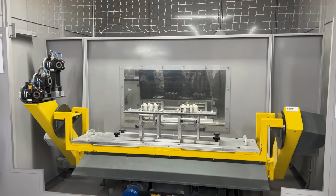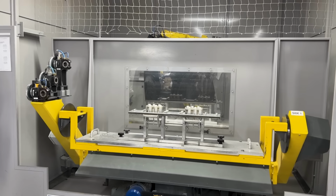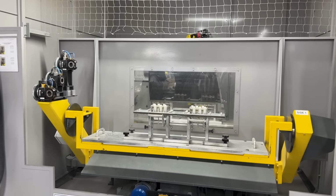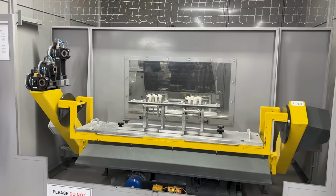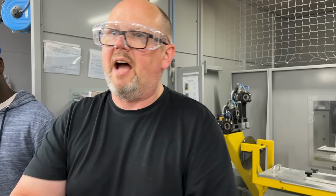And what it's doing is constantly monitoring the amount of pressure it's putting down onto the surface that's pushing up against it. The reason that's relevant, of course, is if you think about a loudspeaker, it's got holes in lots of different places. What we don't want is the robot to push hard on a flat surface and then get to a point where there's an aperture for a drive unit and suddenly dip in. If it dips in, it would round off that nice sharp edge that we want. Clearly, we're not after that. So the sensor gives it the ability to sand right up to the edge, and allows the guys to focus much more on the detail elements. The really substantial sections that previously you'd have been working at for hours, depends on the model.